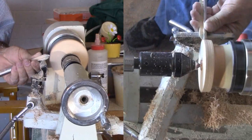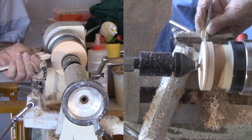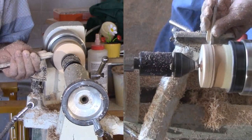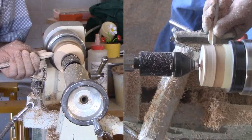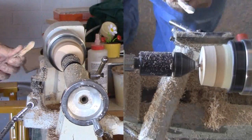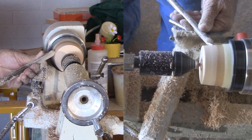For the bottom half, I'll wrap the top with three or four layers of masking tape to cushion it as I reverse it into the jaws of the chuck. I'm surprised at how well it's centered. I'm protecting the wood from being indented by putting a penny between the wood and the point of the tail stock. Poor Mr. Lincoln — now has a dent.